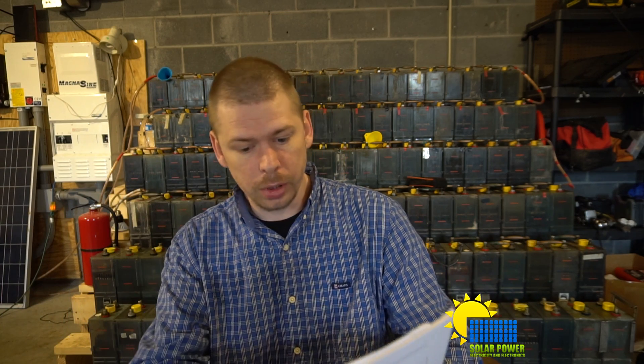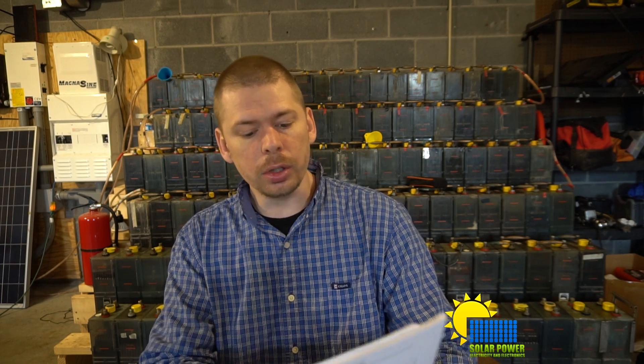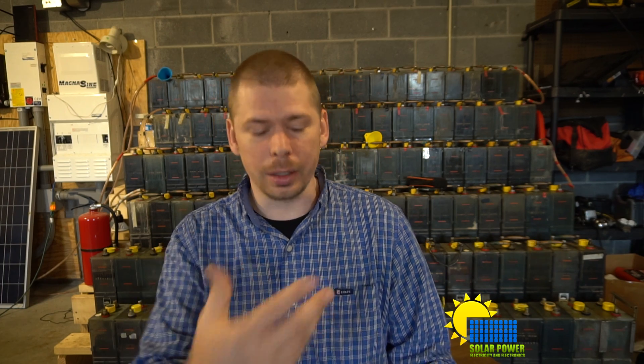Another way to kill your battery: not having enough charge current or solar panels to properly charge the size of your battery bank. Consult the battery manufacturer for minimum charge current. If you have 6,000 amp-hour batteries and only 25 watts of solar, it's not going to work. You need a specific size battery bank for a specific amount of solar panels, and without enough solar the batteries won't properly desulfate during charging.